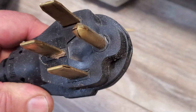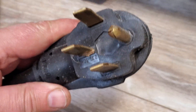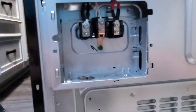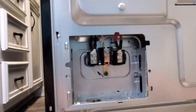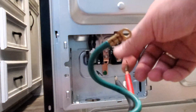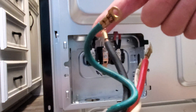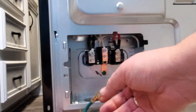If you have connectors like this on the wall and the oven comes with a wall plug, it could be different but it doesn't matter which one it is — it's always going to have this colorful wiring. I'll show you which wire goes where. In our case we have: green which is the ground wire, red which is a hot wire for one load, black which is another hot wire for the other load, and white which is neutral.